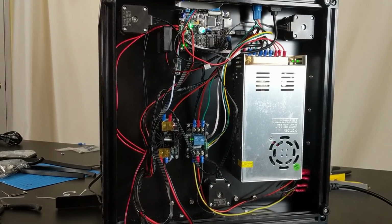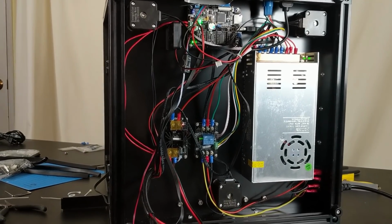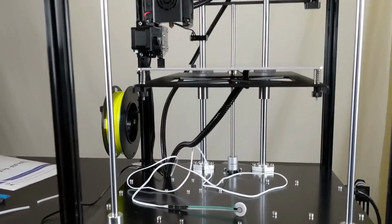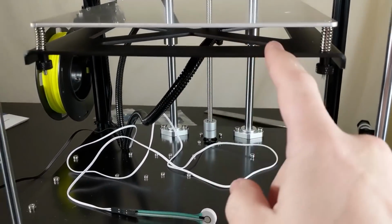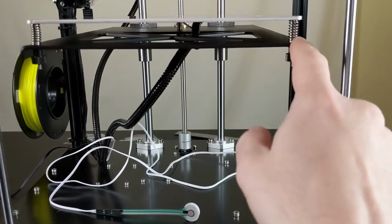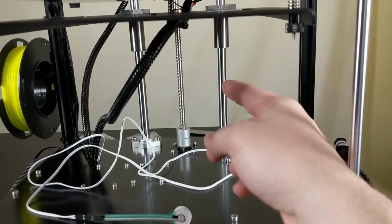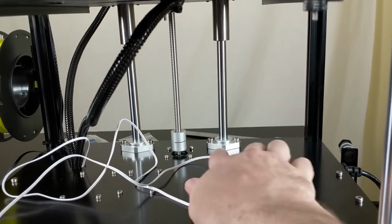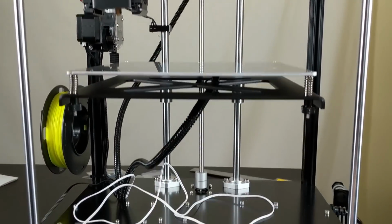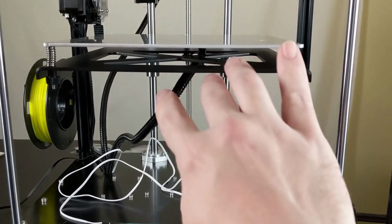It's a little bit funky, so a little quality control issue, nothing tragic, but you know, brown M&Ms, people. It's all assembled, but I've got a couple of issues. First of all, it's sort of intuitive to assemble the bed in this orientation with this just sort of dropping off like that. But this is upside down because these things back here will collide with the base before the bed has dropped to the full height. So you actually lose printer height doing it this way. So I need to flip that around.